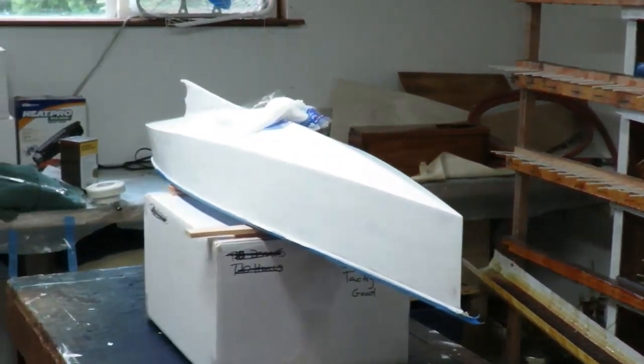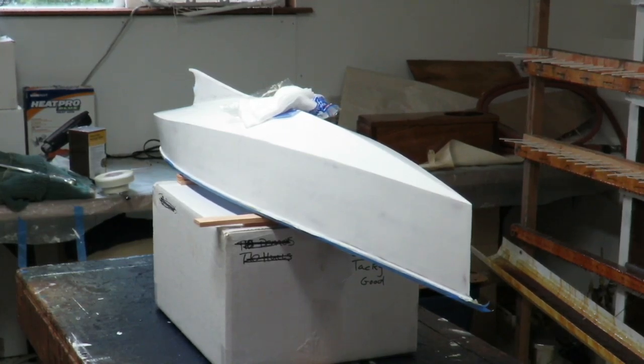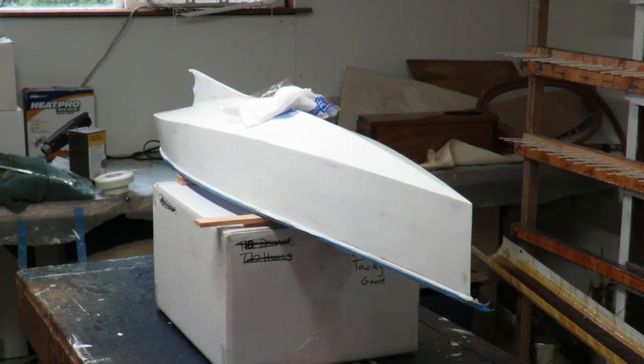So ideally, you want the surface you're spraying to be warm, so the paint, when it hits, won't instantly get thicker. All paints and varnishes and everything are very, very sensitive to temperature, and they get much thicker in colder temperatures. And so you don't get a smooth, thin, even coating in cold temperatures. You get kind of globules and have a lot of problems with running and sagging.